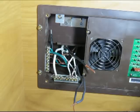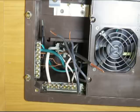So you feed your shore power in through the back, and you can feed your house wires in from the back, and suddenly you have this bird's nest of wiring. And you have to put the green wires, or plain copper wire with no covering on it, which is ground wire, where the green wires go. And the white wires are the neutral wires, and they go on the bottom there. And the black wires hang loose, waiting for the breakers to be installed. So this is just unscrew and rescrew and tighten them down and make sure they're in there tight. You don't need too much extra wire exposed, so keep the insulation in good shape.